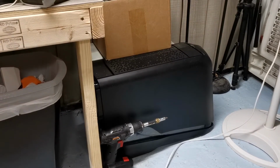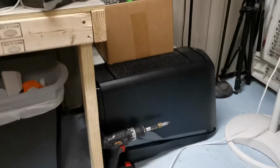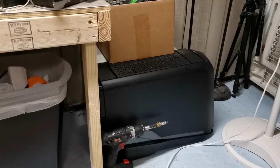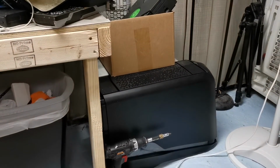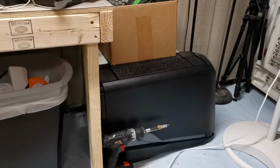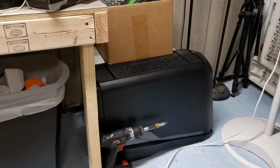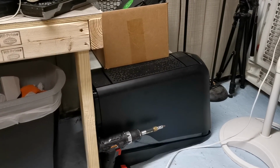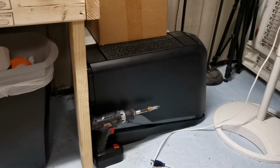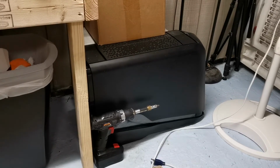And I've never seen this on another board, but underneath where the VRM cooler is, which is of course the VRMs, duh, all of those VRMs where they were soldered on the back of the board, they had all lifted off, broken off the solder pads. And there was enough damage that even though I tried to fix it and resolder it, it wasn't coming back. I've never seen that happen before, but I was a bit upset about that.